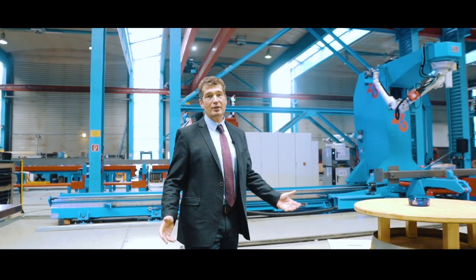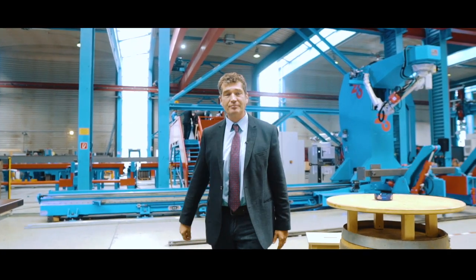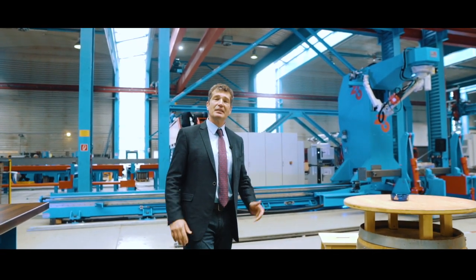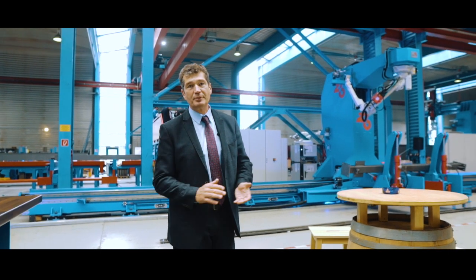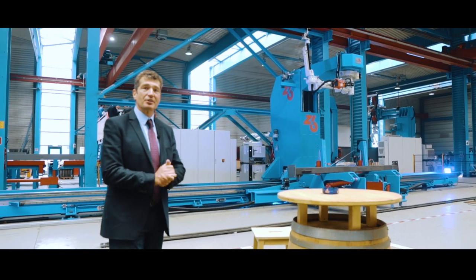You can say assembling takes approximately one minute and 15 seconds per part. Arc-on time on the welding cell is approximately 60%, whereas manual weld-out achieves only about 25% arc-on time for one person working on the machine.